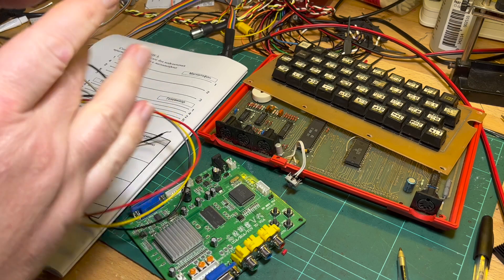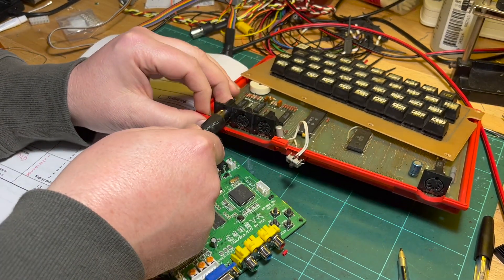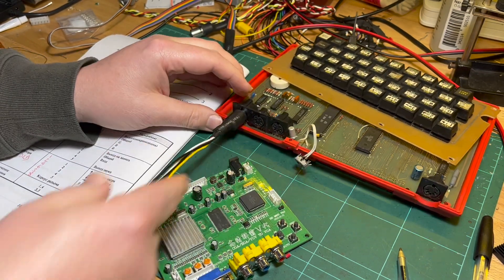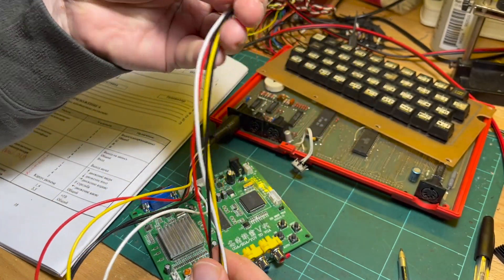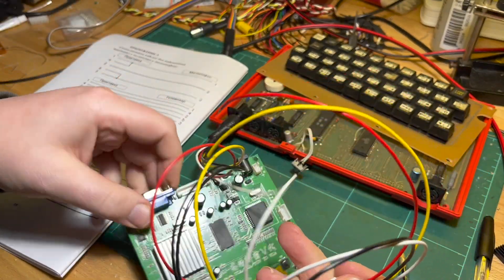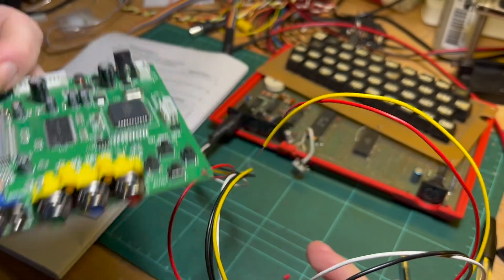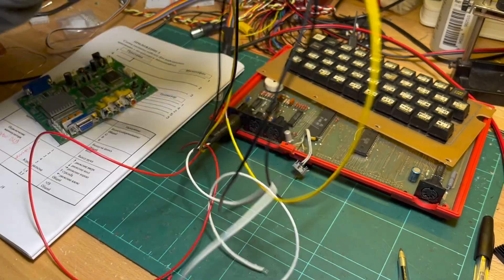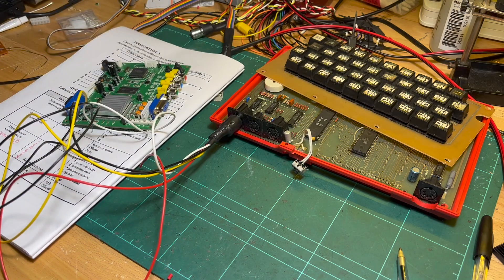This is the cable I've made so far — just a 5-pin. It goes in there. Unfortunately I don't have all the right coloured cables and I can't remember what I've done to it, so I just need to buzz this out first. Then I'm going to solder it directly on just to see if this thing works. Let me just get these tinned up and figure out what's what, then solder them on.